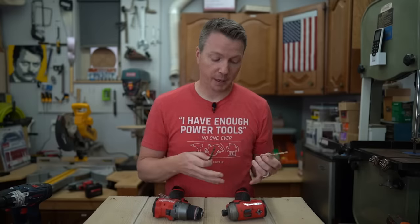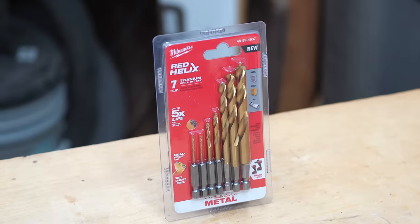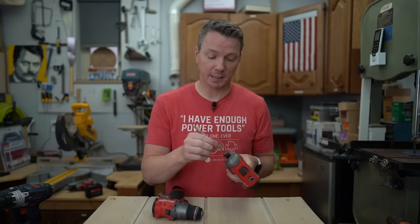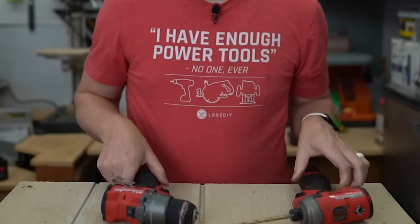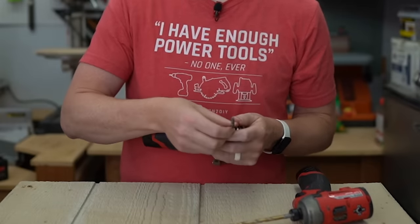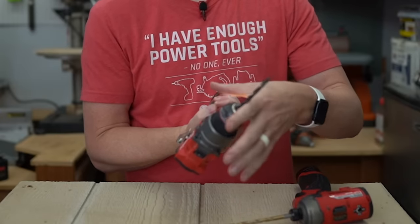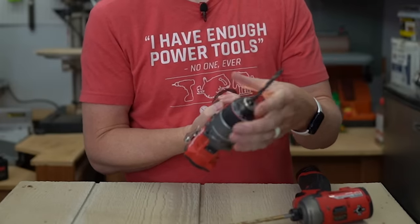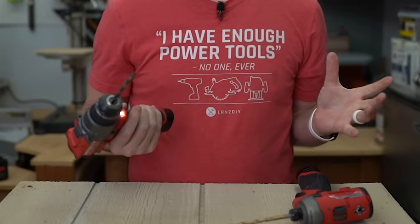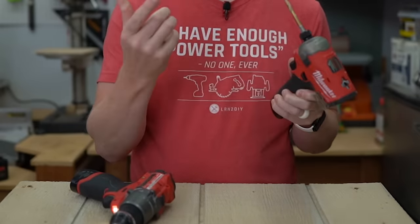A quick safety side note: when loading a traditional fluted drill bit into an impact driver, you obviously can't use a traditional rounded shank — you have to use one with a quarter-inch hex shank. That makes it easy to just clip it in. Unlike chucking up a drill bit by hand, where there's an increased likelihood of cutting your hands on the sharp flutes, with an impact driver it's not even an issue. You just pop the bit in and you're done.